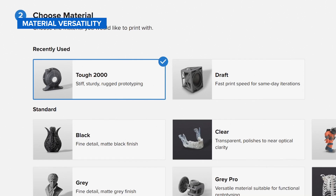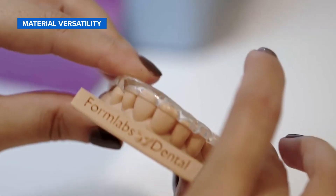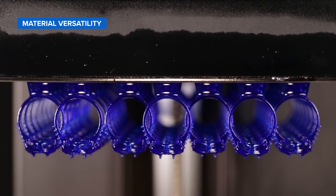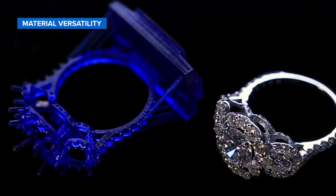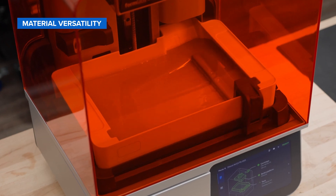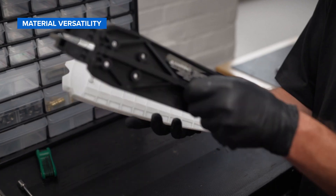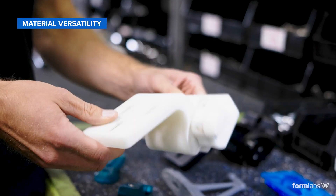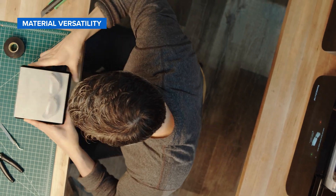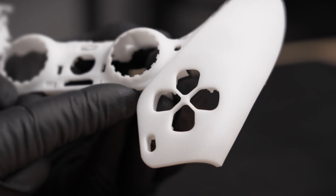There's also a variety of industry-specific resins, like biocompatible materials for healthcare, dental resins that can produce lifelike intraoral appliances like dentures or permanent restorations, as well as castable materials for jewelry. Because resins are formulated specifically for SLA 3D printers, they are not completely analogous to familiar thermal plastics like nylon or ABS used in traditional plastic manufacturing methods like injection molding. Though learning which resin is best for a specific application may take testing and consideration of data sheets, there is an SLA resin for almost every application possible.